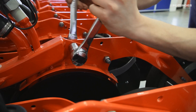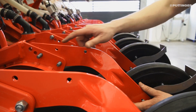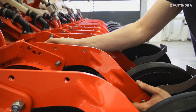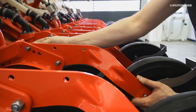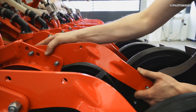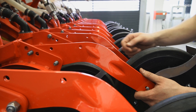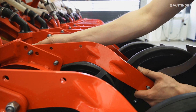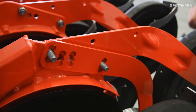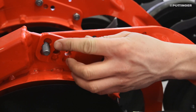To do this, first loosen the bolts on the press wheel. The press wheel is height adjustable using three holes: a shallow seat slot of 0 to 4.5 cm, a standard seat slot of 0.5 to 5 cm, and a deep seat slot of 1.5 to 6 cm. These adjustments enable, for example, deeper placement of the fertilizer next to the maize seed slot. The same triple-hole matrix is used on the firming roller, letting you choose three different positions depending on the size of the maize seed.